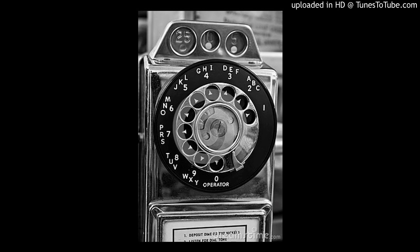The fact that there's no talk battery on the line tells the payphone that it needs to wait for the complete initial deposit before really registering the coin. If there were talk battery on the line, nickels would go right in. But in this condition, a nickel will just be held until the second nickel gets in. Then the ground is made, and the central office will supply dial tone. Once the dial tone is there, you have talk battery across the line, and at that point the audible signal associated with the coins — the beep-beep — sounds. You dial your number, and if the call did not go through, your dime is returned using 130 volts DC. That signal comes from the central office. In one polarity it returns the coin; in the other polarity it collects it, and that is done at the end of the phone call. Pre-pay operation is very rare in independent phone companies.